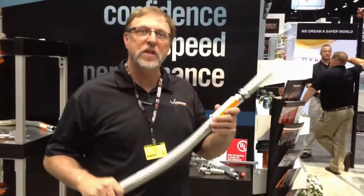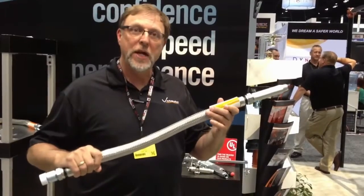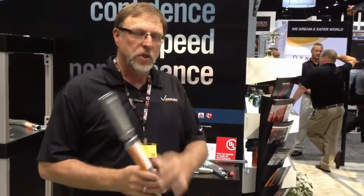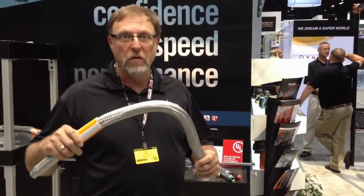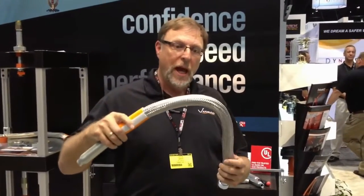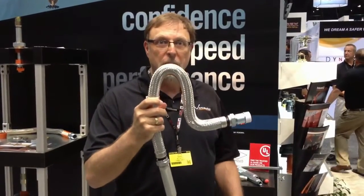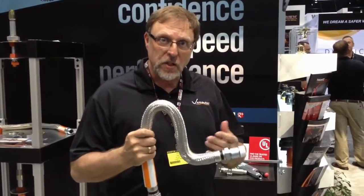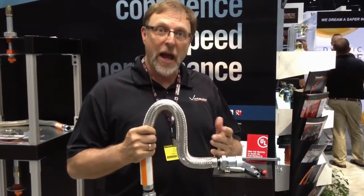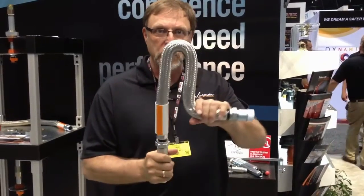Today we want to talk about the AH2 hose. This product was developed specifically with safety in mind. It's a great product from the AHJs and design consultants. It was designed as a result of incorrect installations with the other flexible products that have long bend radius requirements. Those long bend radiuses are an issue when they get installed on a project too tight. So this product was designed — we changed the annealing process of the pipe, we changed the corrugation, we changed the welding process. And as a result, we get a very tight bend radius such as this.